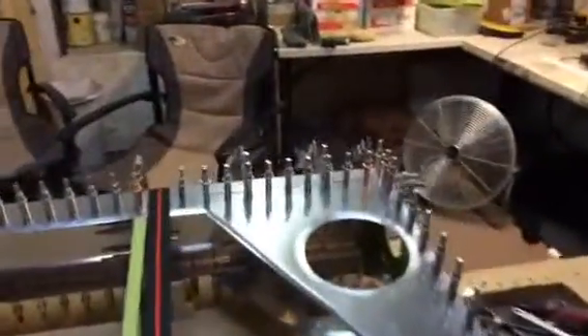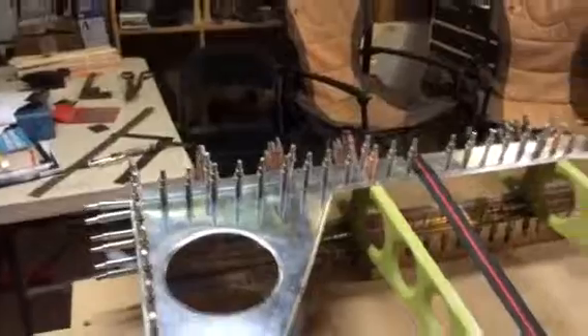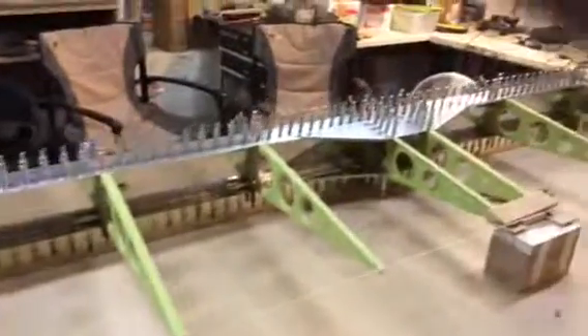Anyways, that's it for the shop. Tomorrow I will disassemble this, etch it and prime it, and reassemble it again with all the clecos. Actually, before I etch and prime it I've got to dimple all the holes — dimple, dimple, dimple — so I'll be doing that all day. My hands will probably be so tired I can't feed myself dinner. But I'm going to get it all dimpled and primed tomorrow, and hopefully maybe even reassembled. So the next update, you won't see any more silver — you'll see primer green. Until then, we'll see you in the shop.